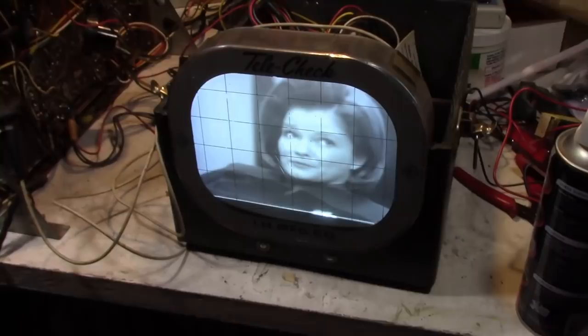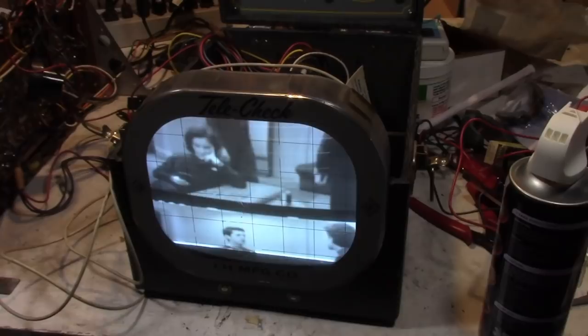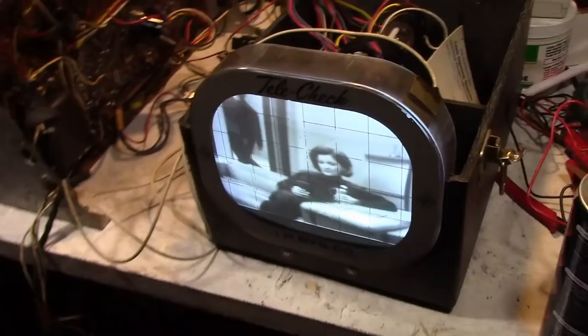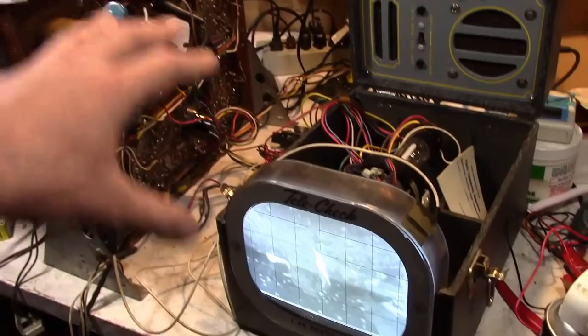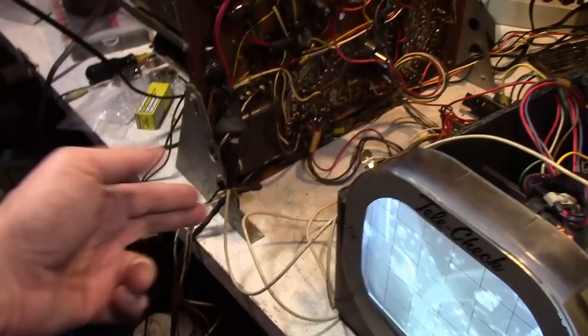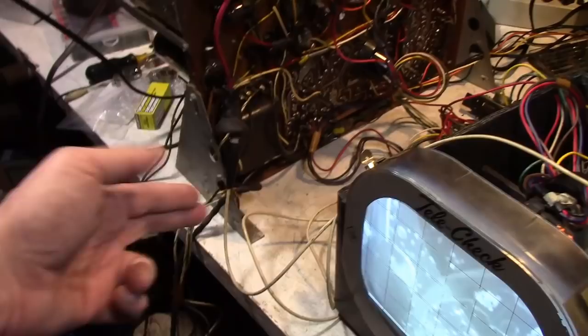And keep in mind, this is only an 8-inch picture tube — the one that's in the full TV is 21 inches. So typically when you use these smaller test CRTs, the image is even sharper because it's smaller. And especially with these test CRTs, because they are auto-focusing, the image should be quite sharp. So I am still poking around. One problem with this setup when you use a test CRT is you've got these wires hanging around — I'd like to check some voltages right now to make sure everything is within spec, but it's kind of hard to do when I've got a high voltage lead hanging out here and all these yoke wires clipped in.